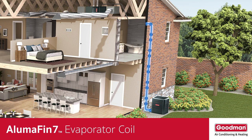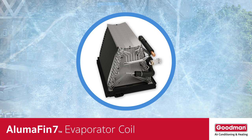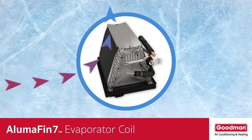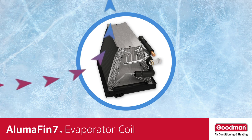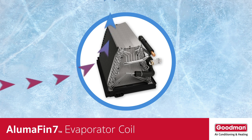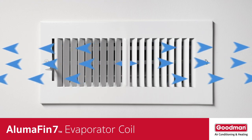This refrigerant travels all the way to the evaporator coil inside your gas furnace or air handler. When the refrigerant arrives at the evaporator coil, it gets very cold — in fact, the evaporator coil itself gets very cold. When the warm humid air from inside your home passes over the cold evaporator coil, the water vapor in that air condenses on the coil. That's a technical way to say the cold evaporator coil removes humidity from the air inside your home. That conditioned air is then returned to your home through the ductwork.